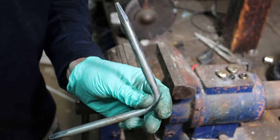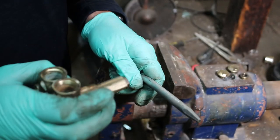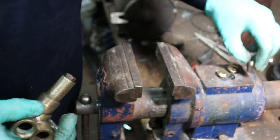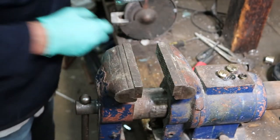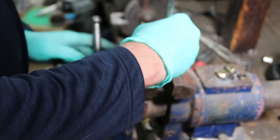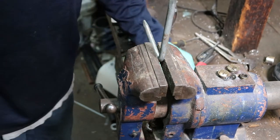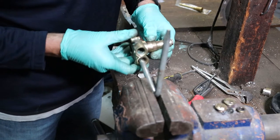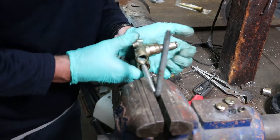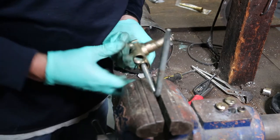I'm using a basic L-shaped seat tool. A seat tool has two different sides — a square side and a hex side. Make sure which seat you have because you don't want to round it out. Check with your new seat: the bottom has a hex to it, so we want to use the hex side. One of the easiest ways to do this: if you have access to a vise, screw the seat tool into a vise, get it good and snug, slide the valve body over the seat tool, and give it a little tap so we don't round these seats out. Once it's in there good, you've got a little leverage — just twist counterclockwise to remove it.